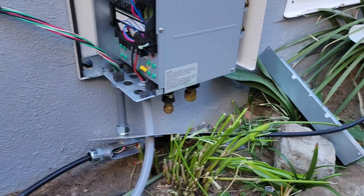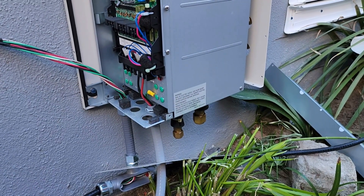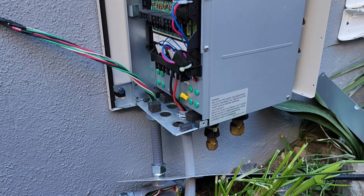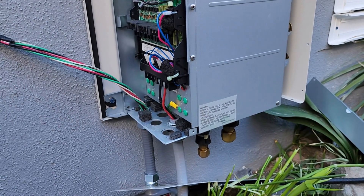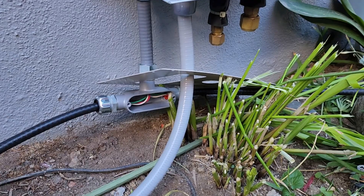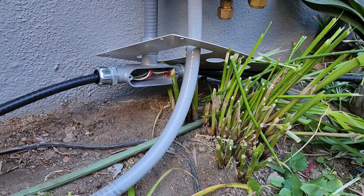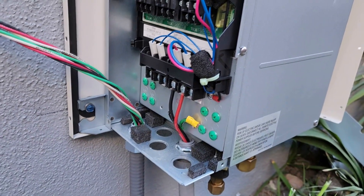On a distribution box, it's good for five units, but they only give you five knockouts, which at first sounds right — five indoor units, five knockouts. However, you need another knockout for the power from the outdoor unit and another for the communication from the outdoor unit. So you really need seven, which you don't have. They expect you to double up on the communication cables to the indoor units. I used a conduit-type T-body to get two separate indoor unit communication cables in together and up into the distribution box.